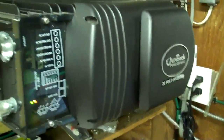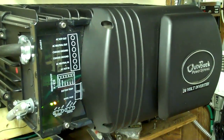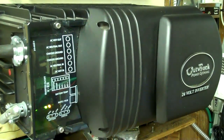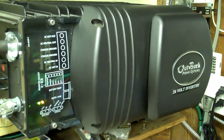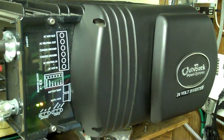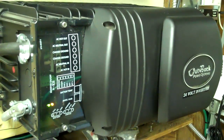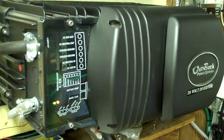Just a word to the wise: if you're planning on linking one of these up to a generator at all, they kind of tell you not to do it. I actually do it — I can run my generator and have this thing charge up my battery bank. But the problem is you've got to have really clean power to do it, because these things will reject it in a second, then click back over, then check again. It surely can't be good for the inverter. Also, when you're running your generator off-grid with one of these inverters, the grid tie is actually going to push against your generator, which can get confusing for everything. They just don't recommend doing generators on these at all.